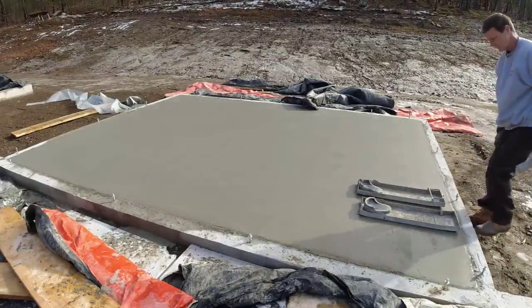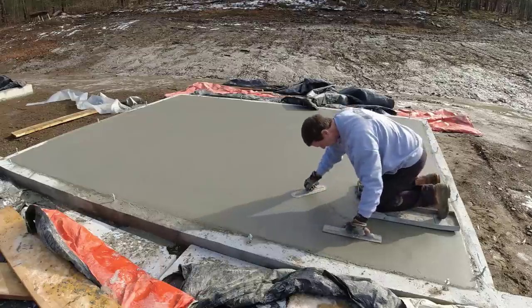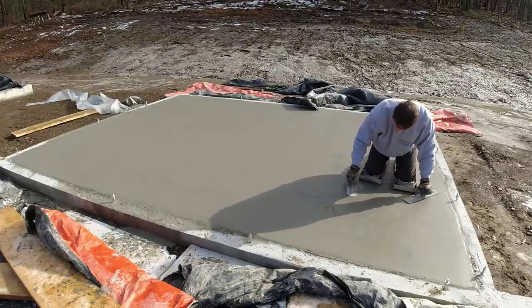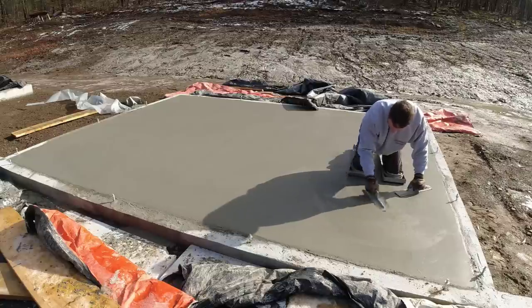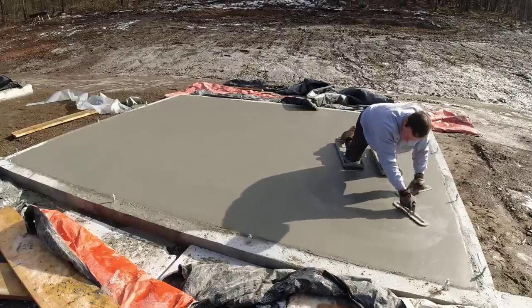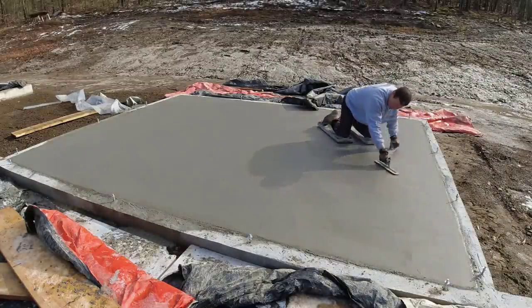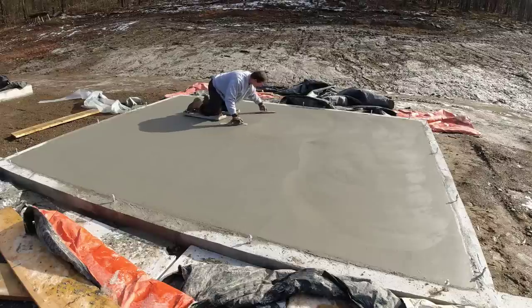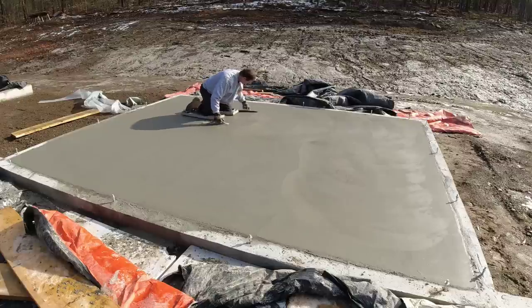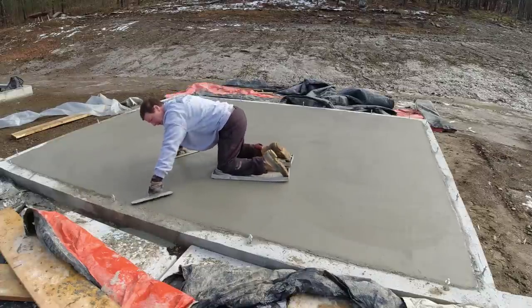This is going to be my last hit — things are getting pretty smooth now. Let me know what you think: is that a smooth enough finish to do basically any type of flooring if they change their mind, or if they just want to stain the concrete? I'm going to get it pretty smooth just in case, even though I'm not a big fan of staining. If we want to do an epoxy coating we've got to grind it anyway, so that's not a big deal. If we do a thin overlay like a ⅜-inch stamped overlay, part of the prep is grinding the concrete, then we put down a primer and the overlay and stamp it. So the smoothness is probably good enough as it is right now — we left all options on the table.